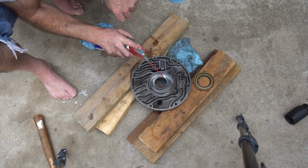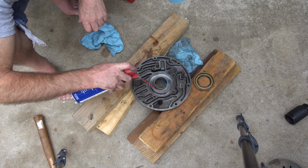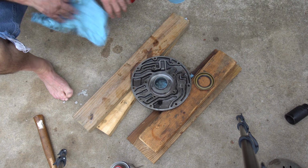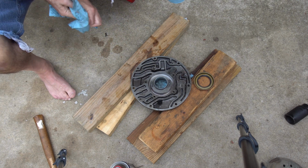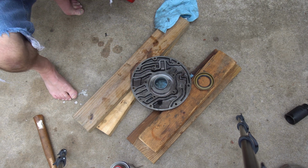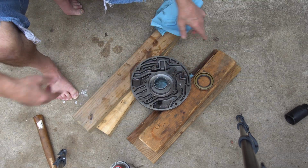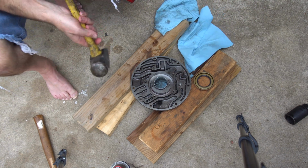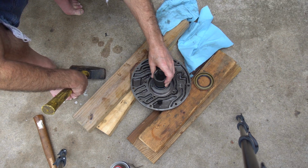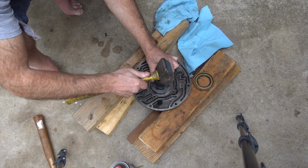Alright, so now he's going to go ahead and get this bearing started. So far the difference is we got a GM F11 bearing, and then we got a Clevite 1588 bearing. I got this kit off Amazon. Apparently this kit came from Phoenix Transmission Parts. Not a sponsor, but see how this kit does. Reach over there and get that hammer thing? Socket. We're using a 36 mil socket, and that seems to work pretty good with it.